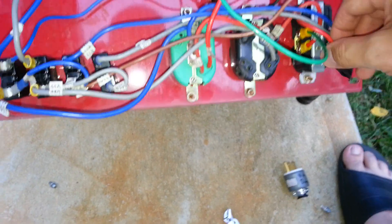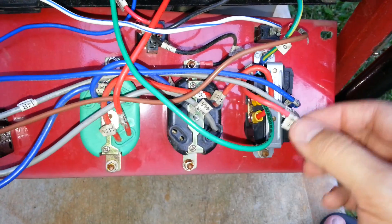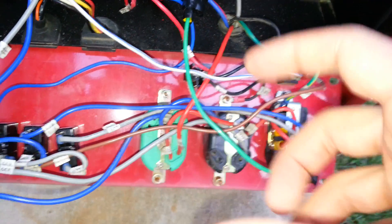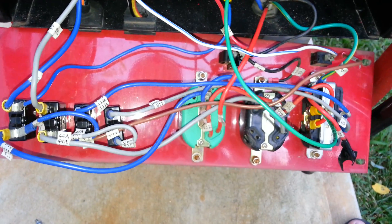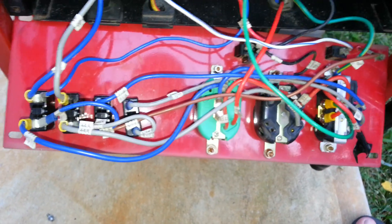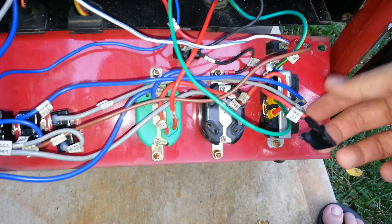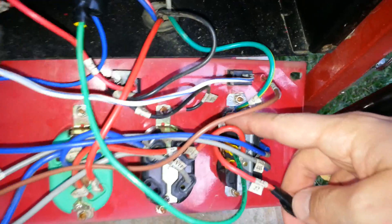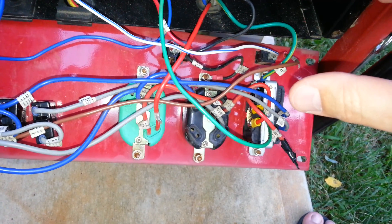There's a little jumper wire right here — I have it taped off now. This is normally jumpered to the neutral, and this wire is connected to the ground right here. This green wire runs all the way down to where your rectifiers are and is held in by the mounting bolt. To make this work with a two-pole transfer switch, you need to remove this jumper first — this is what goes to the ground screw right here. Lifting the ground there will isolate the neutral from the frame.